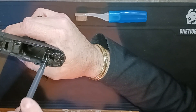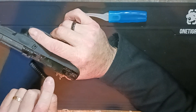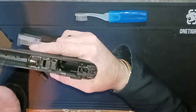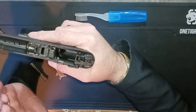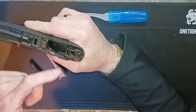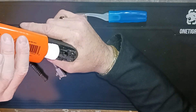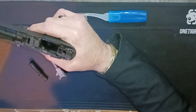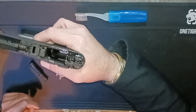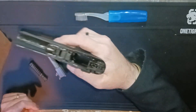It was just shaking that little bit, so when you would move the gun it would actually click side to side. Just that little bit of movement would do that. A quick fix for anyone having that issue — it was because it didn't have enough oil in it. It was dry. Literally just a drop or two of oil on that, then work the trigger back and forth to activate the mechanism.